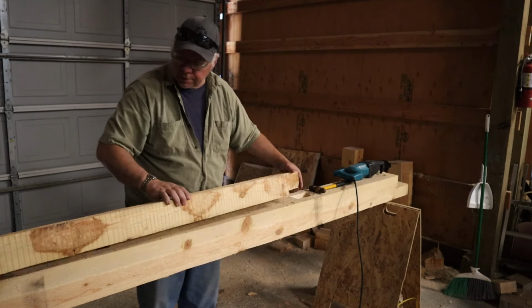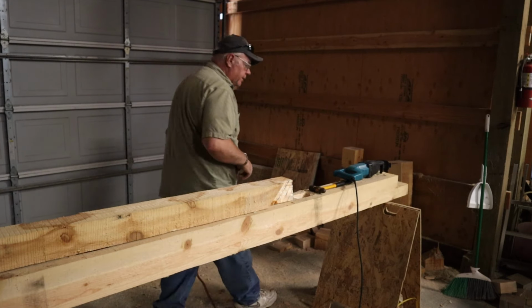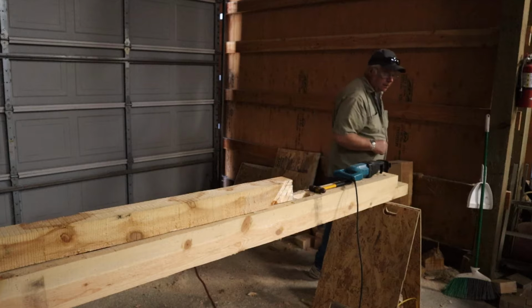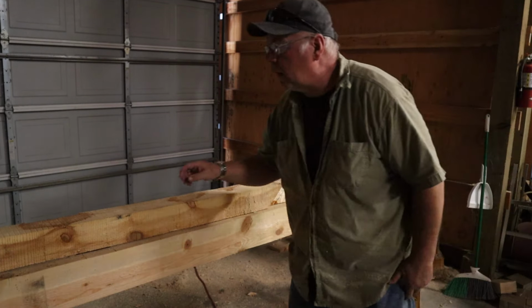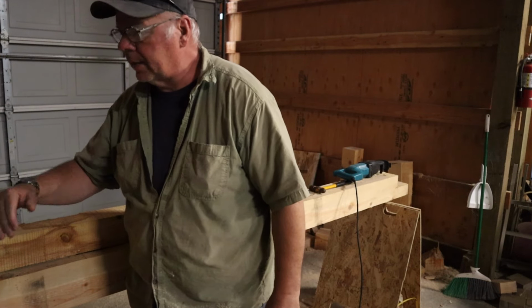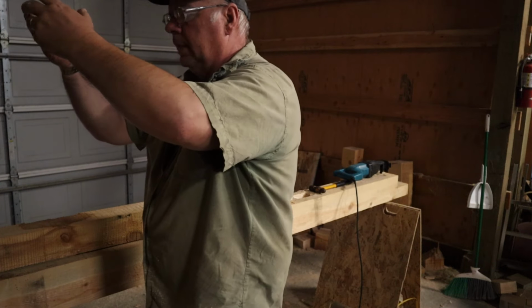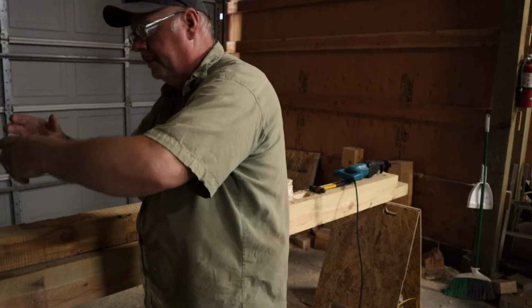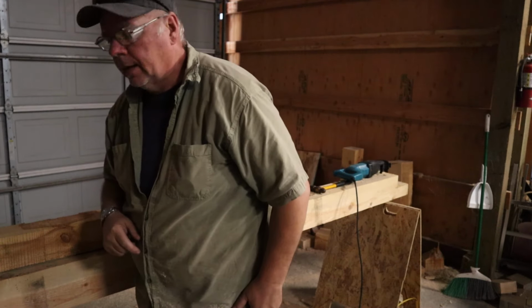But anyway, I told you on the previous video that this video would be about knee braces, and that's how I've been doing the knee braces so far. And then once I get a few of the knee braces up, I'll actually show you my progress. I have another header, and I can't put a header up yet because the knee braces, you actually got to pick up the header, put the knee brace in the socket, and then go down in order for it to wedge together. But that's what I've been doing today. And thank you.